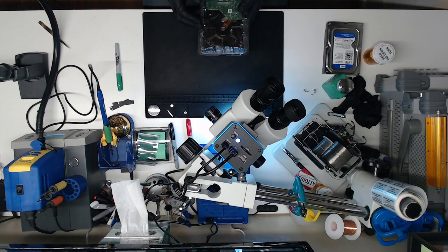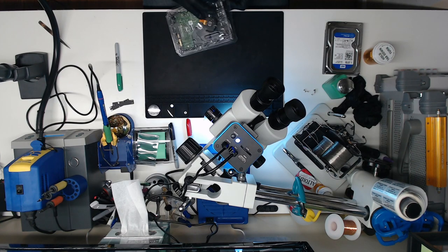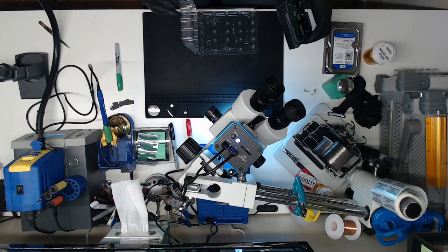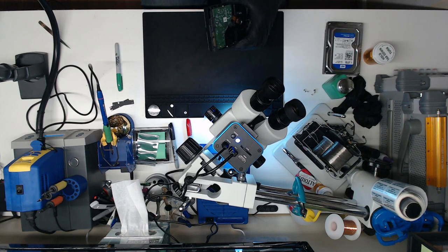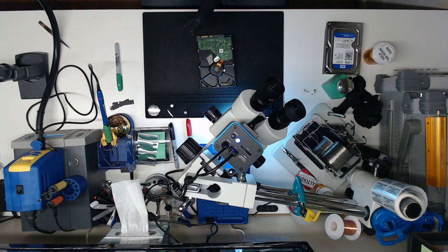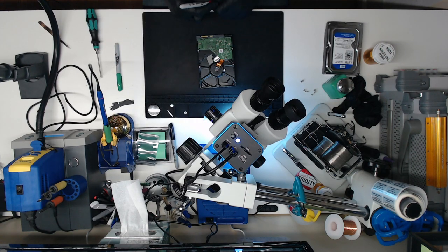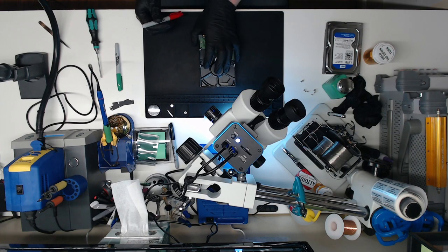This is our donor. This is our other drive that needs the chips pulled off. Nice little clamshell. So we're going to gently set that down, and it looks like that's a T8 screwdriver. Indeed it is. We're going to take our T8 screwdriver and remove this board off of this dead drive. Oh, before we do that, we're going to color this QR code red, just so we know which one is which.